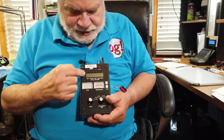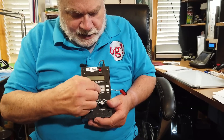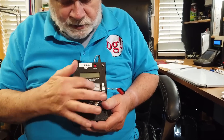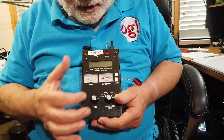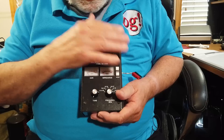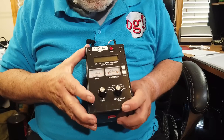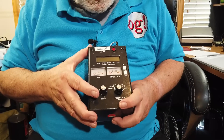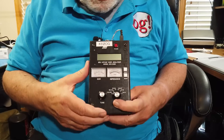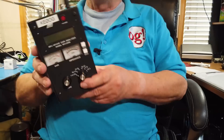The MFJ will show a digital representation of the SWR and then the impedance. Very often you find resonance but the impedance is off, so you have to compromise a little bit. This particular unit tunes anywhere on the HF band and all the way up — it's got a special notch for two meters — and you can go across the band and search for the null. I happen to really like that.